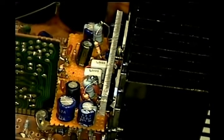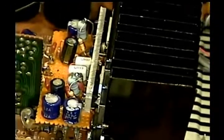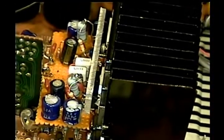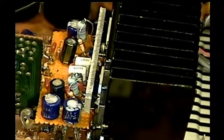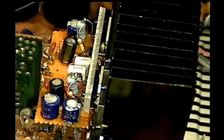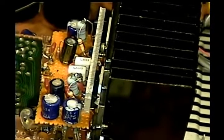I ended up taking a small piece of perfboard and a pair of LM3886 ICs and built a replacement power amplifier assembly. My son recommended the IC. I looked up the specs and found out it had an advanced protection system, and by the description it should have very good sound — and indeed it does. So I built my own power amplifier for it and it sounds great.